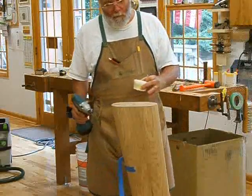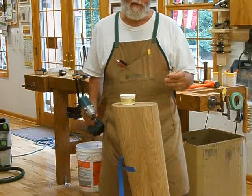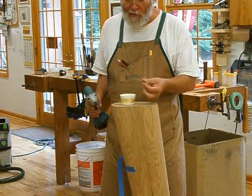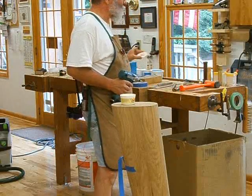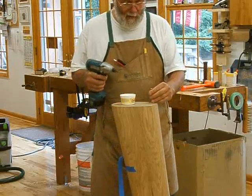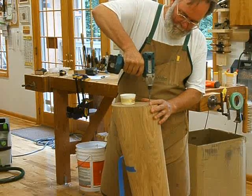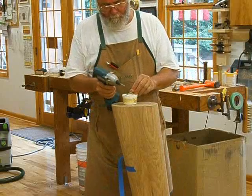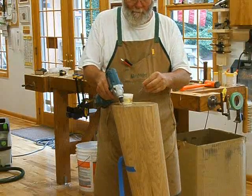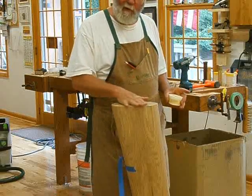When you're dealing with a hardwood like white oak, it's not a bad idea to pre-thread your holes before you put the thing together for the final time — it makes it easier. Plus I'm using a little screw lubricant called Lloyd's Akinpucky. I can't remember exactly where I got it, but it's kind of like a little waxy soap. Now I know I won't have any problems later on trying to get the screws in.